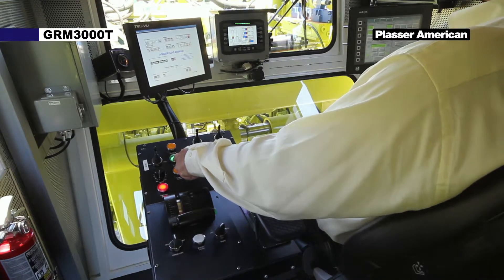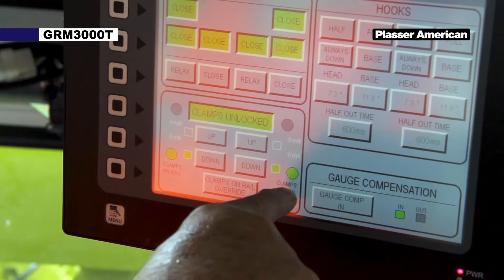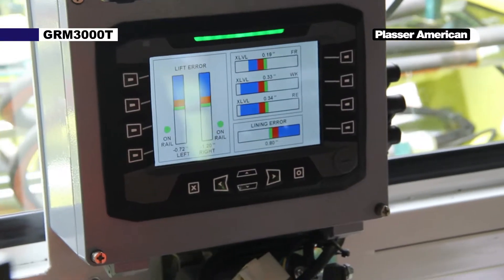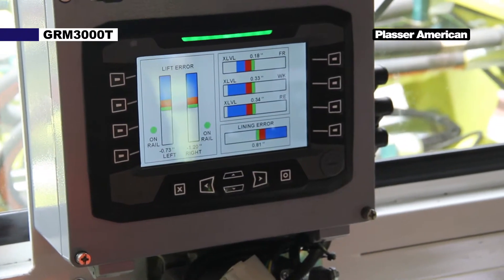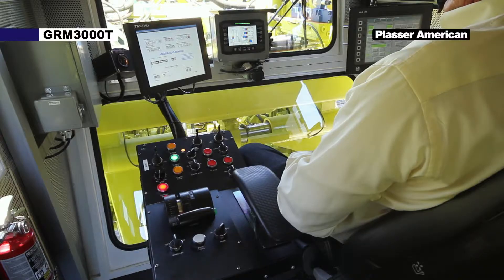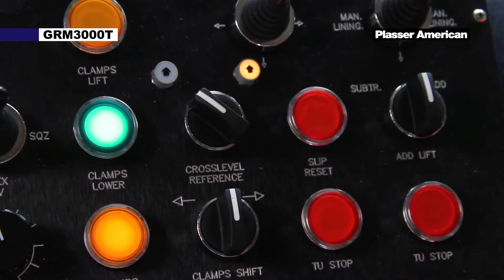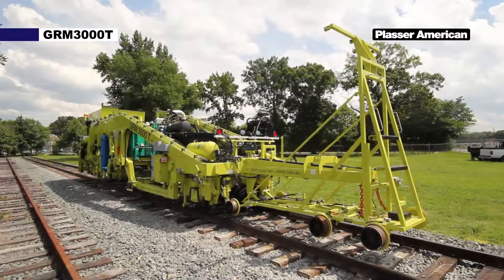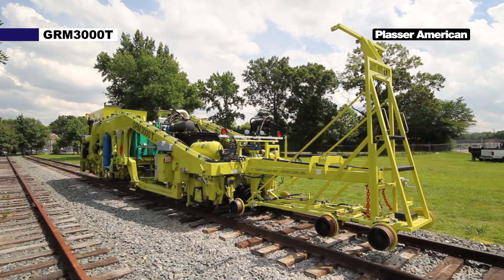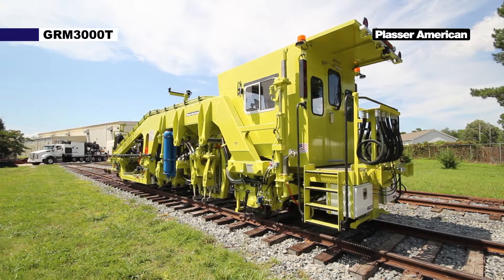When the clamps are on the rail, you will get an indication either on the B9 panel or the clamp screen. On the B52 panel, select the lining reference — this will be the high rail in a curve or the field side in tangent. On the B51 panel, set the cross level switch to the opposite position of the lining reference; this will be the low rail in a curve. This completes the basic work setup. To work the machine, you would make adjustments or change settings in the various screens on the PLC.